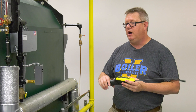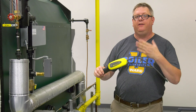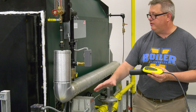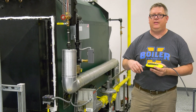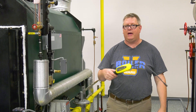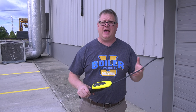One way of doing this external testing is with a leak detector. If we're going to test with a leak detector, we can do a portion of the test with the boiler off, up to the first safety shutoff valve. But in order to test the rest of the gas train, we'll have to be firing the boiler, or else we won't have gas pressure in that half of the component. First thing we've got to do is allow our gas detector to calibrate, and we're going to go find some outside air to do that. It's important to calibrate any sort of gas sniffer outside so that we have fresh air.